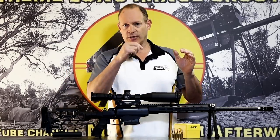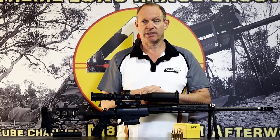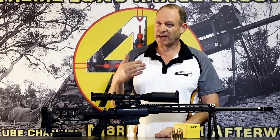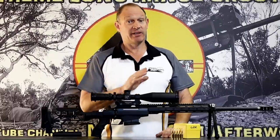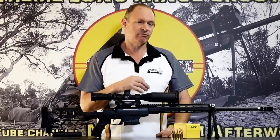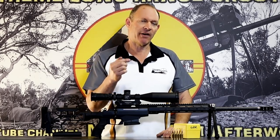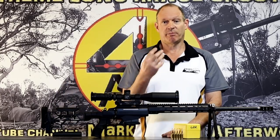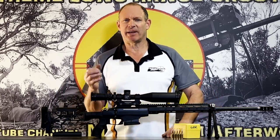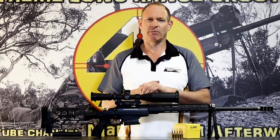If you end up with 2-3 thou, you're bumping your shoulder back and that's your head space. If you end up with 10 or 15 or 20 thou of movement where that round can move backwards and forwards, then there's all sorts of things that can go on. Case head separation, all sorts of things can happen in that situation. But here's the firing pin protrusion. Primer problems can happen out of those same things, the round going forward, pushing back and bouncing around. That can cause problems as well.